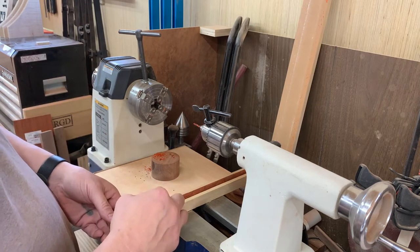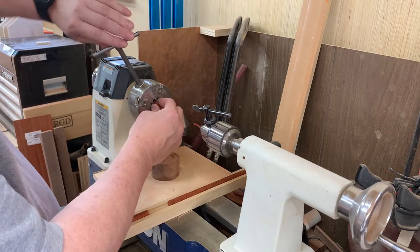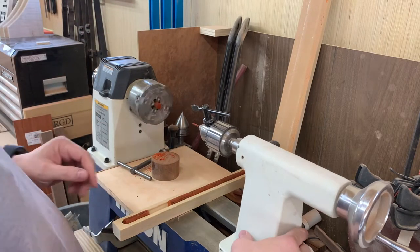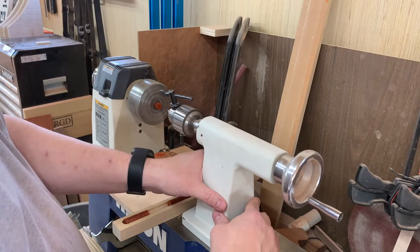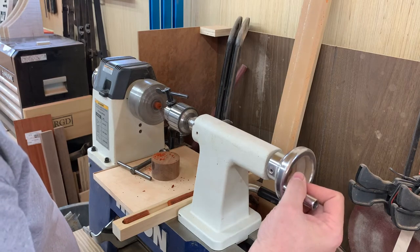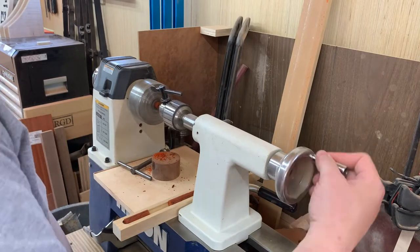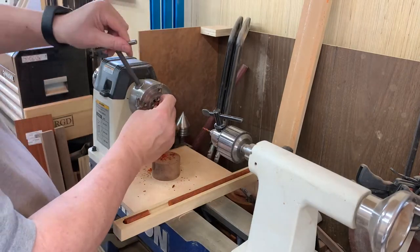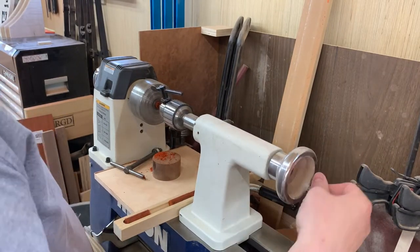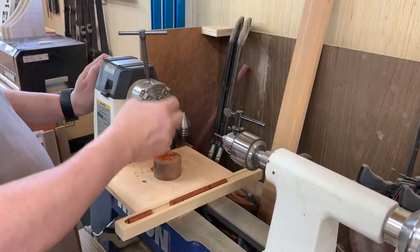So we put it back in its place in the holder, and I pull out the next segment. Unload it. Turn this on, throw the chips, bring it up, lock it down, and we're real slow to find center. So we release this from here.